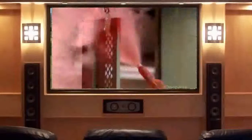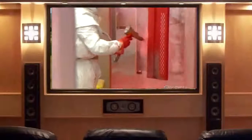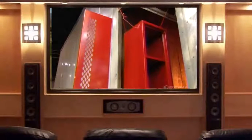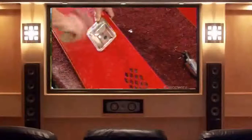All the parts now head into the factory's paint shop. The powder paint used for this model contains electrically charged silver particles, a natural disinfectant that kills any bacteria, viruses, and fungi on the locker surface. Once coated, the parts go into an oven for half an hour to bake the paint.